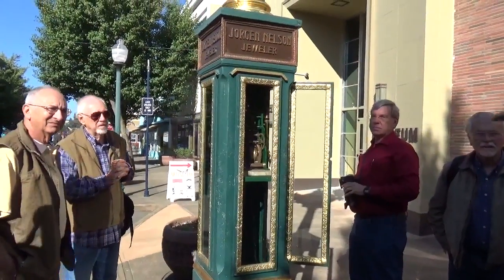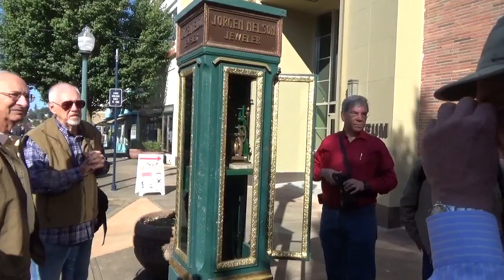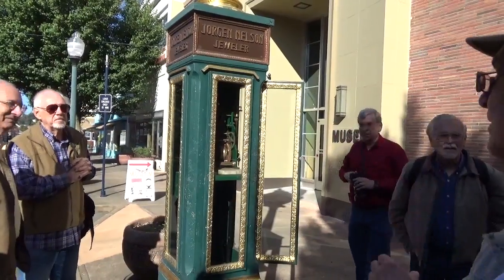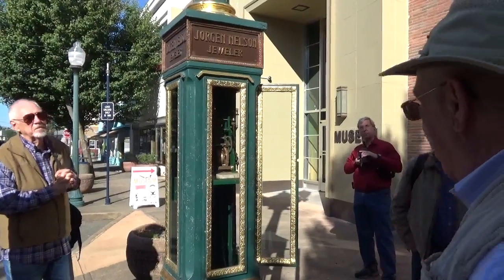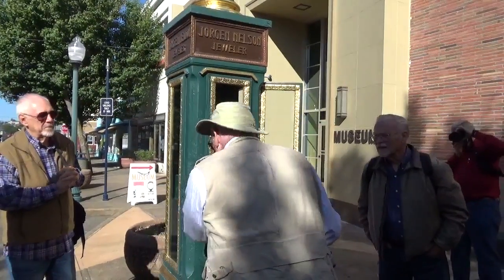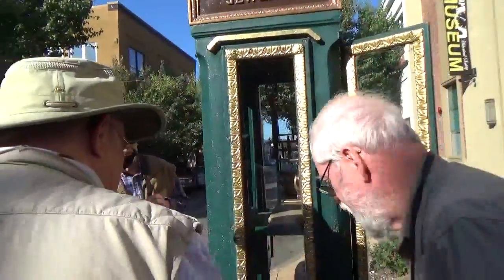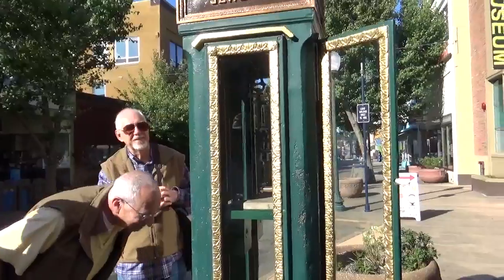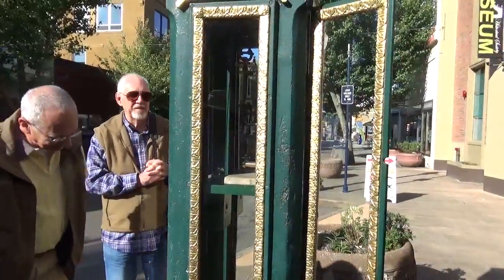We were messing with it, and a guy was visiting that I correspond with on an email list. He's a professor of mathematics who lives in New Zealand, but as an American grew up in Oregon, and he's a major clock guy. We're showing off our clocks, and he's standing here looking down in there, and he says, the rub marks on that cable. We hadn't been careful in routing the cable, and the pendulum was rubbing on the cable, and that was completely screwing things up. Actually, the cable wouldn't stay down. Over time, it came back up a little bit. It would work its way up. And so we had our New Zealand troubleshooter.